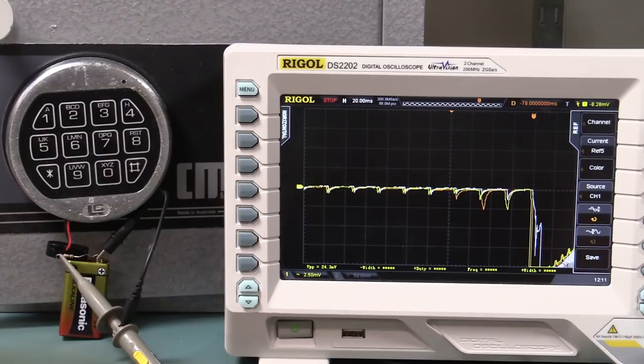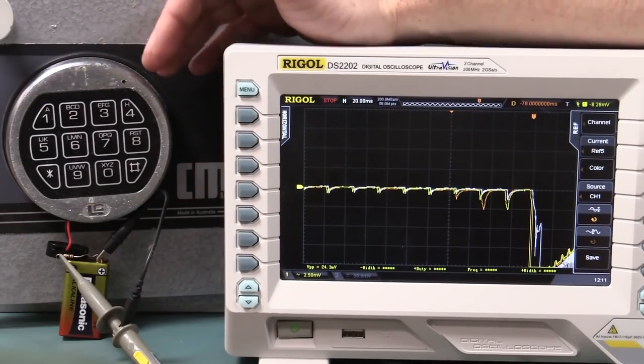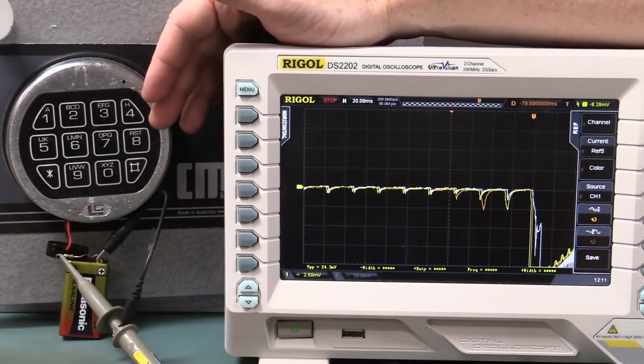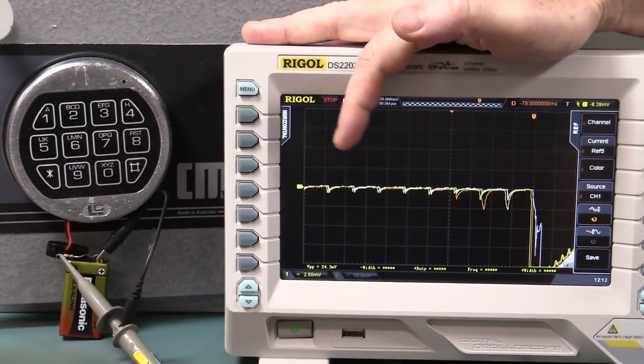It's not entirely repeatable, and I'm not sure what the deal is, whether that's a deliberate decoy in the firmware, because on a well-designed product like this, they'd be aware of power line attacks, and you'd expect them to build in some randomness, or do some tricks in firmware to mask that sort of thing. So, yeah, perhaps that's what they're doing. Even if there is a vulnerability there, once again, like the two-digit sequence before, how does that help us? Not much at all. So really, that's all I wanted to check for today.